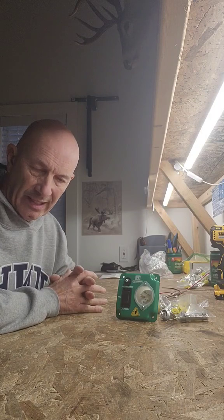If you purchased a transfer switch, it has to have a UL1008. None of the transfer switches that you see on Amazon and eBay that are from overseas have that. They may have a UL label for one piece of their switch, but not the entire unit as a whole and tested.